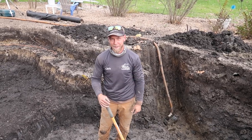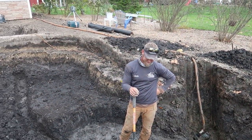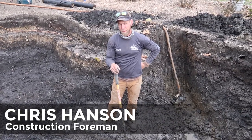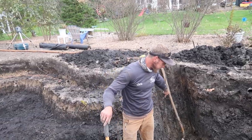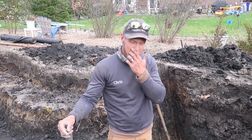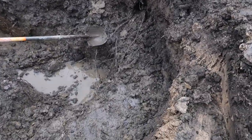We're still out here day one, just Chris and I. Digging seems to never end and let me show you why. Chris, explain a little bit what's going on — I left the viewers with the suspense of how we're going to handle this groundwater. It's not just coming in from one area, it's like all over. When we got back from grabbing lunch, the trough we dug for the snorkel and centipede had eight to ten inches of water in it after only about an hour. You can see it's coming in from over here, coming in from the back side over there — it's not stopping, and it hasn't rained in four or five days.